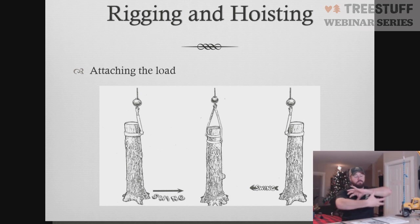So make sure when you attach your slings — if you're making a cut on the bottom of the tree — you don't want to be standing on the side where the sling attachment is, because this piece is going to want to push that direction. If you do the secret handshake, where you come at it from this side, you're being picked uniformly from the middle and the piece is going to lift up nice and straight. Look at the canopy, look at the structure, and figure out where your slings can be attached to find that center of gravity. We're always trying to find center of gravity.